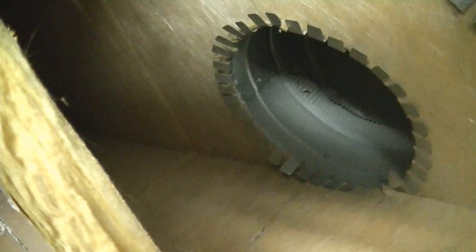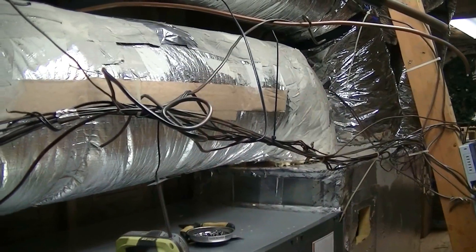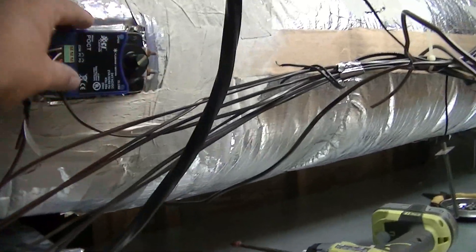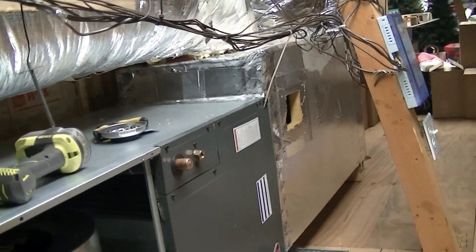Got a little access hole in so I can see where the bypass was. There are some of the duct board fittings — they just bend tabs over to fasten them in place. There's the attic air duct; it's been sweating a little bit. Now we have our bypass duct back in place. We're taping the joints and we're going to mastic them as well. We have to start rewiring up the zone components. This is the bypass damper, and it works on a static pressure switch mounted in the supply duct. Depending on the static pressure in the duct, it'll open and shut the damper to bypass a certain amount of air back to the unit, trying to maintain a set static pressure.